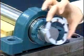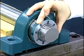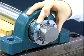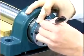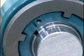Find a lock nut hole that aligns with the lock plate hole or slot. If the closest lock nut hole is beyond a lock plate hole, mark the adapter at the next closest lock plate hole. Tighten, not loosen, the lock nut to meet with the lock plate hole or slot.